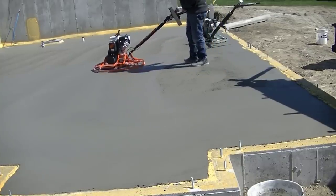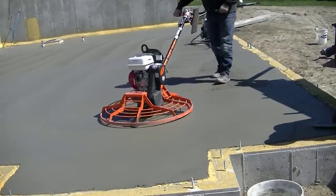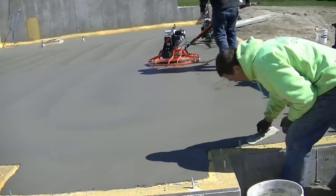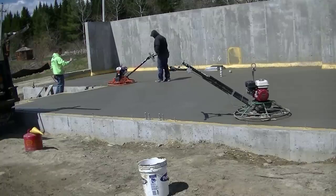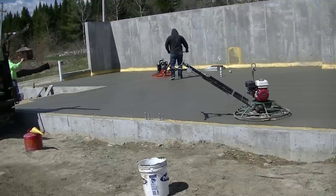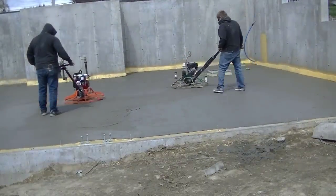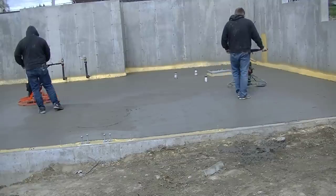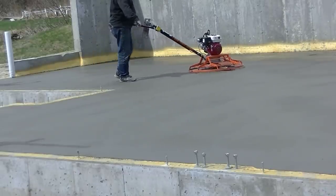We've used this MBW power trowel a couple times now and my guys really like it — it's a high-RPM, low-vibration handle design, so it's really smooth operating. My guys love the high RPMs. You can see I'm troweling Luke's edges for him — whenever we hit the floor with the power trowel, we always have a guy go around and buzz the edges to make sure they come out really nice. We finish it probably three or four times with the power trowel — hit the floor, let it dry, hit it again, let it dry. Every time you hit it after letting it dry, it gets a little smoother and smoother. Darren's finishing up floating that very last truck, then we'll switch to finish blades on that power trowel too if we need it.